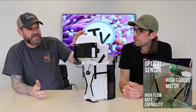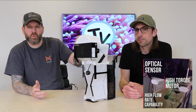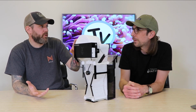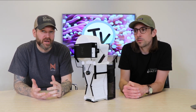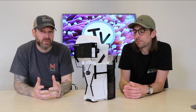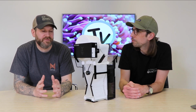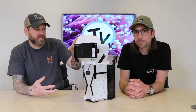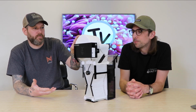As for fleeces for this unit, they do quite a range of different microns depending on what size particles you want to filter out of your water. So they start from 9 micron to 17 micron, 25 and 32. So they really do a nice range of filter fleeces, and the good thing with these, they're all 65 metres long. Wow. So they're going to give you quite a bit of length of time before you need to change them.